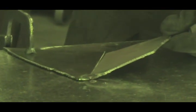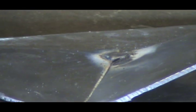Just putting some tacks on there — just a couple of little tacks so I can get my fingers away from it while I'm welding. You watching on this end? Now I'll show you how to just tap it. So, just two different ways: scratch it like a match, get your distance right so you can work it along and start your puddle going, or you just tap it. Either way will work.